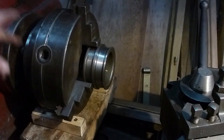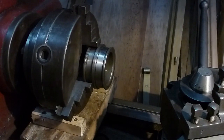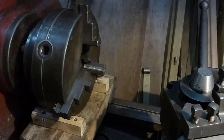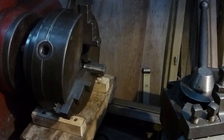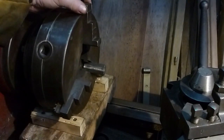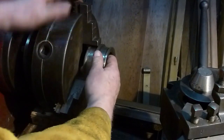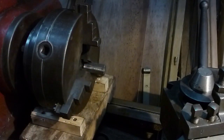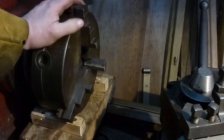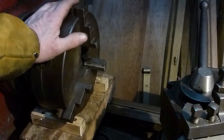It's really a lot easier if you take these precautions — it makes chuck-changing a relatively quick operation. These chuck jaws are really, really worn. The final thing is that this is about the maximum size I can put in this chuck, which is a bit ridiculous, because with this three-jaw chuck I've got no more capacity than I have with my little Emco 8x18 — and this is a 13x42. So I've come to a conclusion: the only thing for me to do is to buy another chuck.